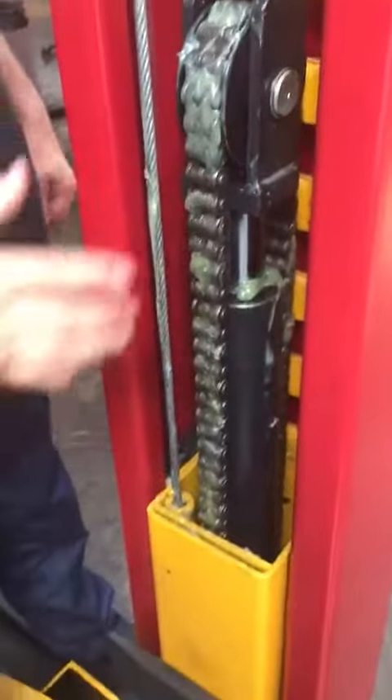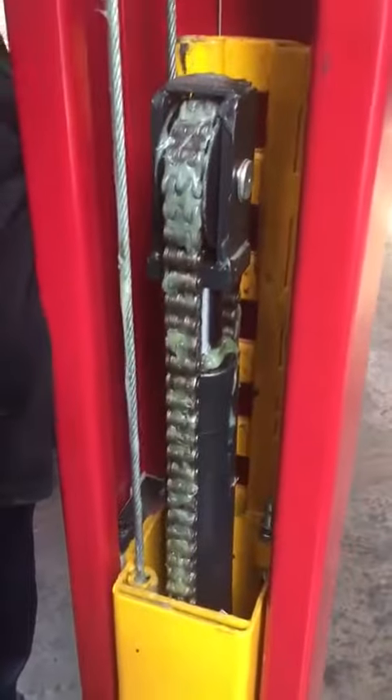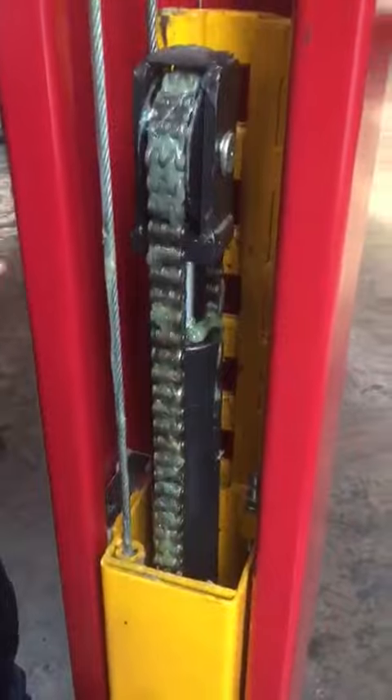Inside here it's lubricated properly, so the amount of grease spent on this could be put more towards the inside. Also, make sure these lock nuts are locked. This one used to have a lock nut but it's not locked — you can see I can undo it with my fingers without needing a number 17 wrench. That's about the basics.